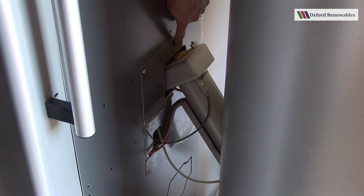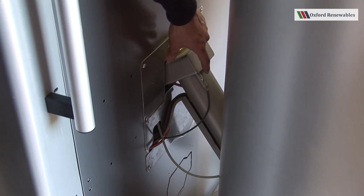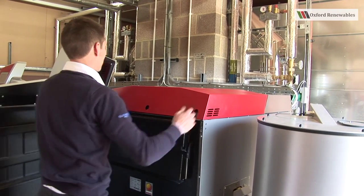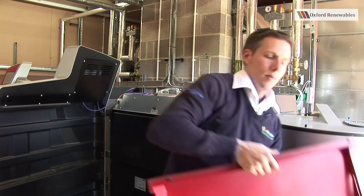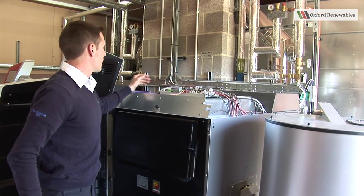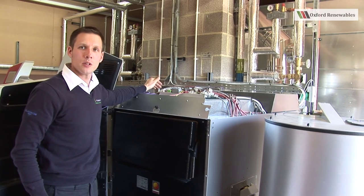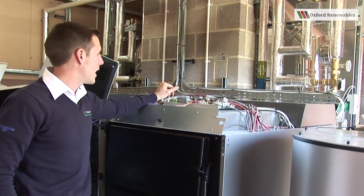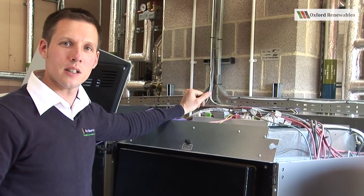When it's working you can see the tip of the auger rotating. This is a safety device — this is the feeder temperature sensor. If I take the red cover off the boiler we can see what's underneath. There's really only one component under the red cover and that is the boiler's power module. This is where all the components of the boiler are controlled, and also in certain circumstances pumps and mixers connected with the heating circuits.